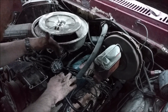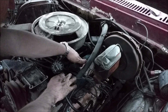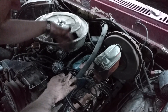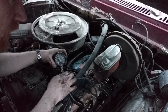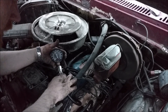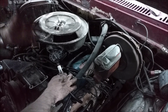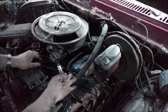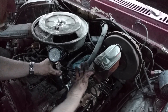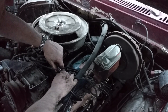That means the piston rings in the first good cylinder are sealing really well — about as good as they can. Where the second cylinder jumped 15 to 16 psi, the piston rings are definitely more worn. Still, it's pretty close to the other ones and nothing I'd be concerned about unless I was closer to 100 psi. The general rule of thumb is about 10% variance — so about 10 psi. I'm a little bit out of that range, but not scary. I'd be really concerned at 20 or more. But this is an old girl; she runs good.